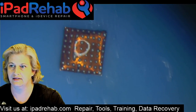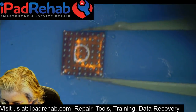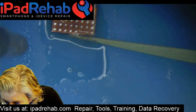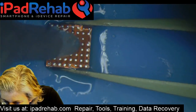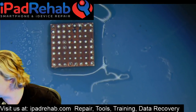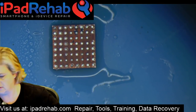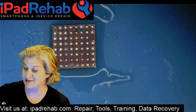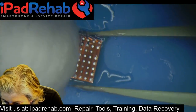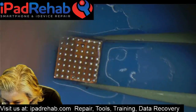All right. Non-leaded is irritating to use. It is, and it is unnecessary. There's nothing good about it other than the fact that it's good for the environment. And at an industrial scale, sure, it does make sense. If we were making a million iPhones, then those are all going to end up in somebody's backyard, and we would want to use lead-free solder. But we are fixing devices and keeping them from the landfill and giving them extra life. So for that, we are going to stack the deck in favor of being actually able to execute our repair, and we're going to use the best solder that we can, which is good old 1975's finest leaded solder. All right, so we're going to clean off this chip,